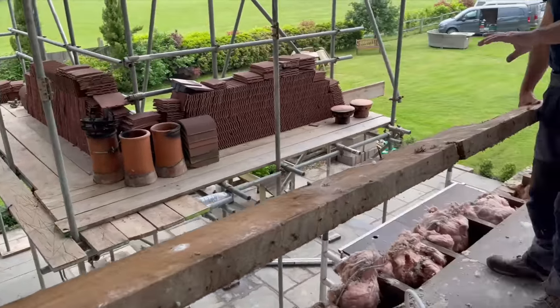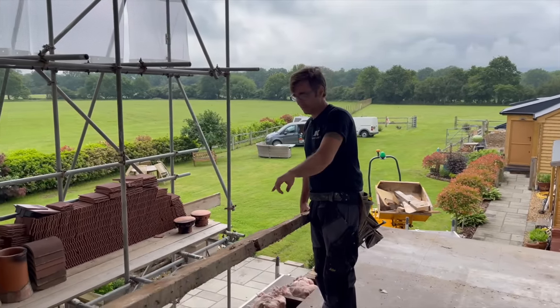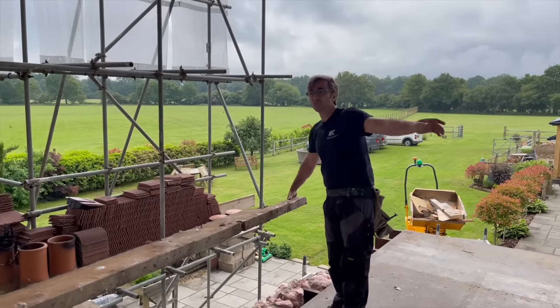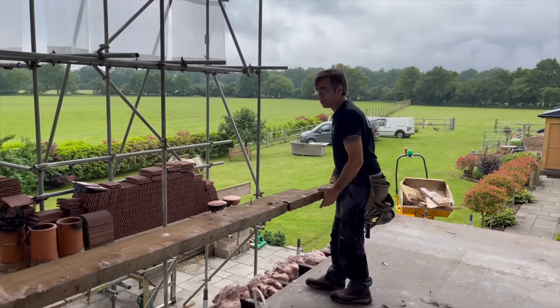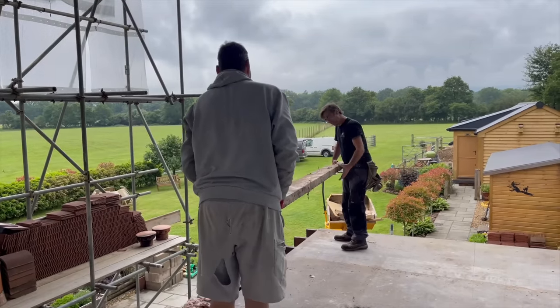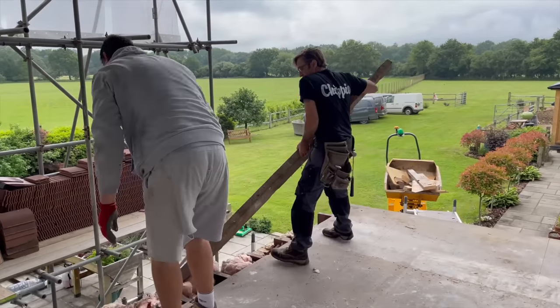Three nails in that whole wall plate there. The rafters aren't tied to the sides of the ceiling joists. So basically that was just ready to push off. There's three nails holding all that. Yeah, that roof was doing that the whole time, pressure. It's just pushing it out. Roof spread. That's just outrageous. Now, what we do is slide it over the edge there and I'll let it go down as the elbow.